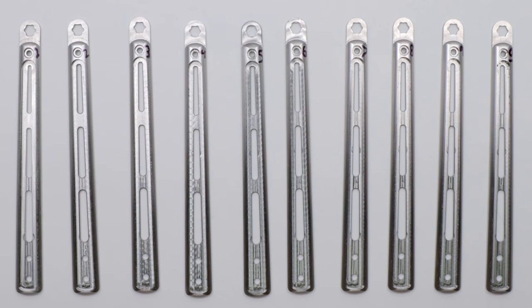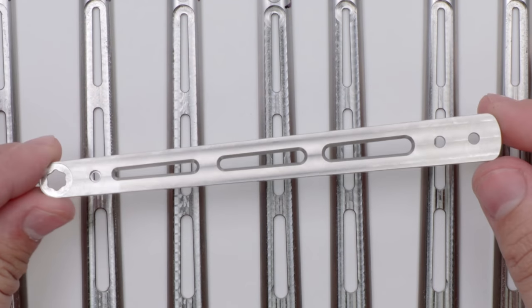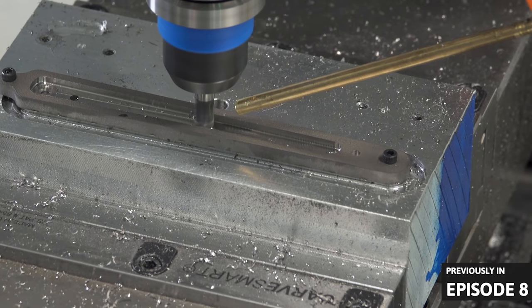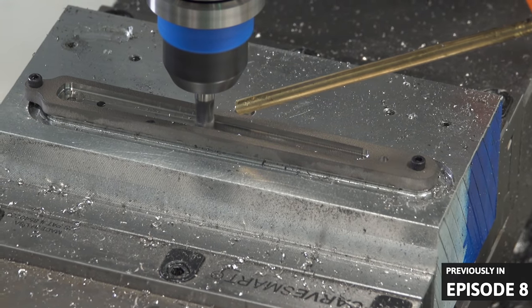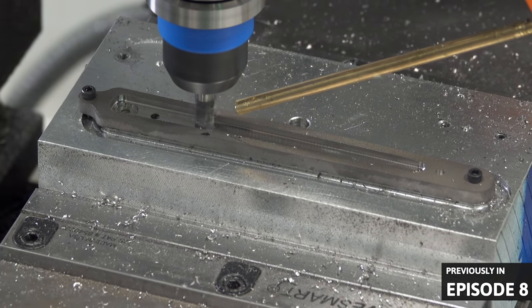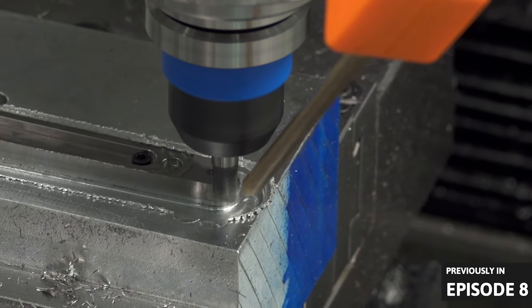I made more than enough to test the mechanism, but now that I have everything running nice, I feel like I should give titanium another try. I think my biggest problem machining titanium was that I didn't use coolant. I've been using air because I wanted to make filming easier. I'm actually surprised how much I've been able to do without coolant. Titanium might be the limit though.